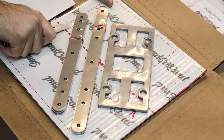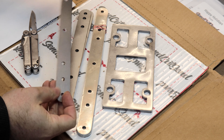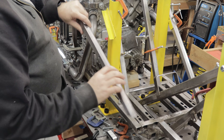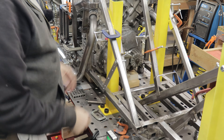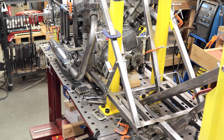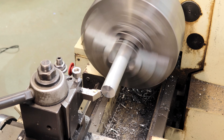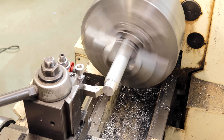Next I would need to mount the radiators to the frame. The radiators are each mounted to the frame with a pair of parallel steel bars — I had these cut by SendCutSend. I drilled a quarter inch hole in the upper angled frame piece and then mounted that back onto the frame. I put the radiator mounting bar onto the frame and aligned it to the correct angle, then center punched it and drilled the hole out. I could then bolt it through the bottom hole as well. These radiator mount holes were about five-eighths inch in diameter but I just needed about a quarter inch for the mounts, so I made these aluminum spacers as adapters which also hold the radiator off of the steel mounting bar about one-eighth inch away.